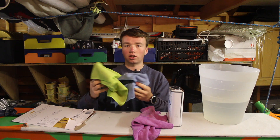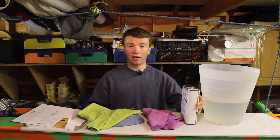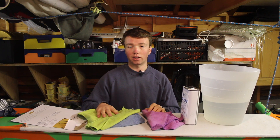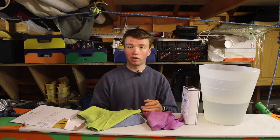I've got some cloths so that I can clean the boat as I'm going along using water, making sure to get all of the dust away so it doesn't clog up the surface. I've got some acetone solvent which is really good for getting rid of any residue left on the boat from the stickers, making sure it's really clean before moving on to the next stages. I've got a bucket of water to use with the sandpaper and the cloths. It's worth remembering to change the water when you change grade of sandpaper, because the dust that comes off can clog up the new piece of sandpaper and leave scratches that you don't want.